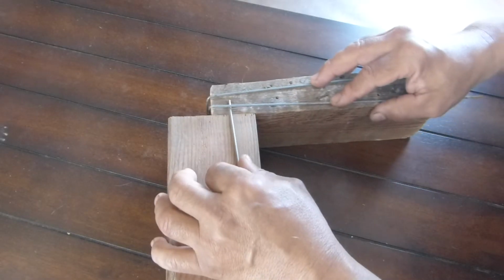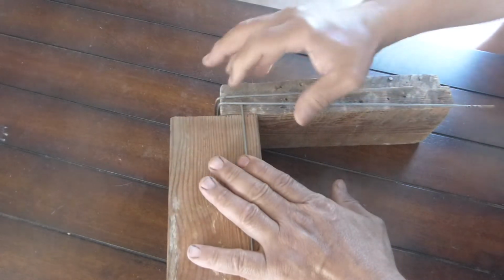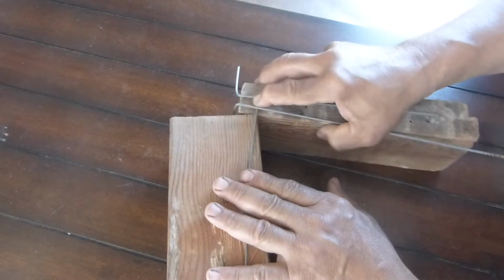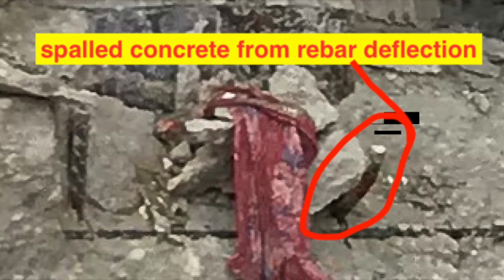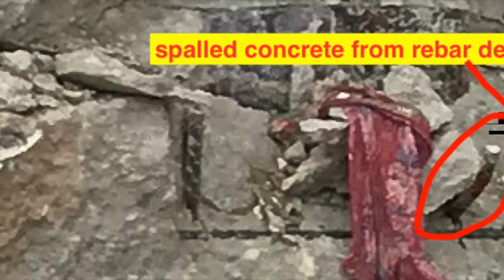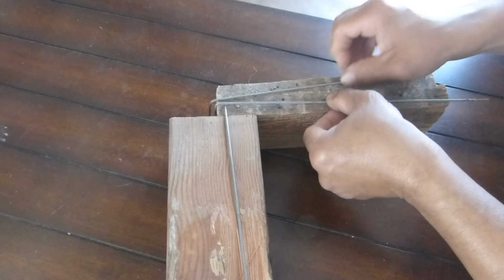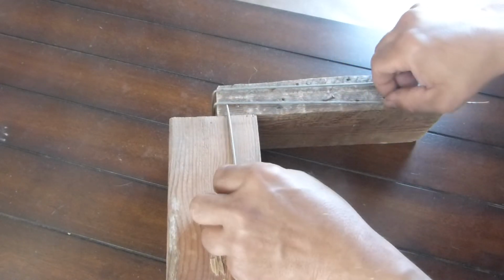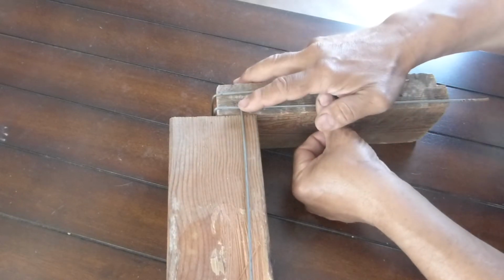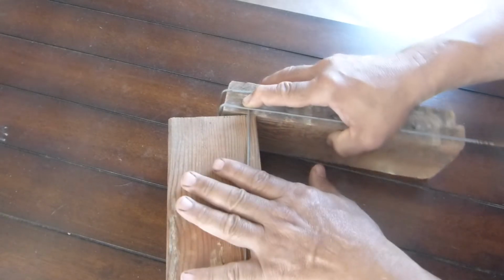Did you see what happened there? I'm not saying it's sliding at all. It's locked in place here with that. And if I could lock it with my finger, you'd see what I mean. As it goes down, it spalls off this concrete right here. Now some of the steel might have been anchored back there, depending on the profile of the wall. But I would theorize not, that it's more hooked behind it like that. So I'm going to lock it with my finger. Let the deck go down, and you get your spalling and your rip off here.